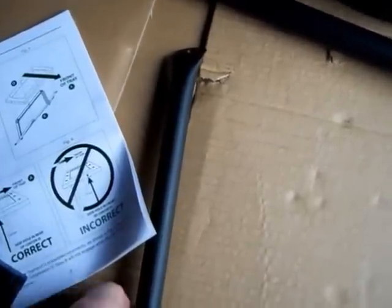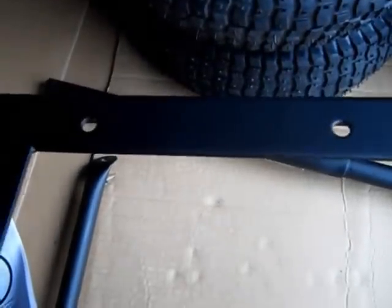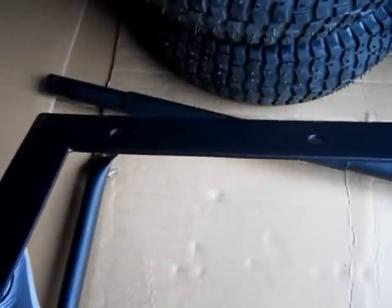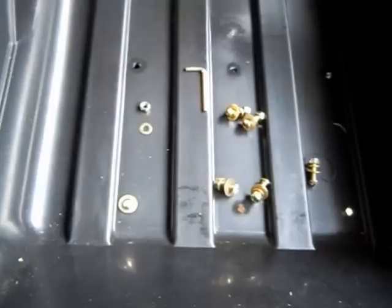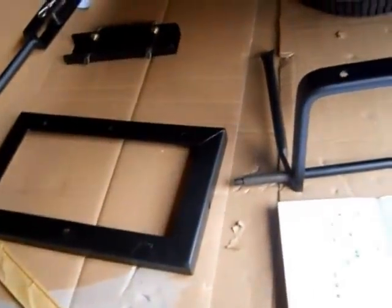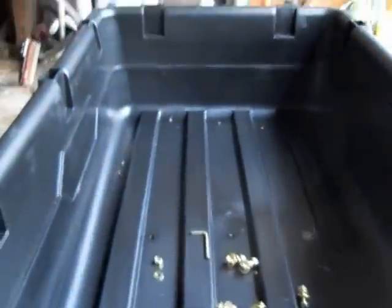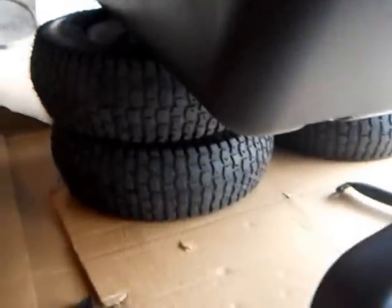I think I've figured it out. I slid them on so that the flat end is pointing down at the cardboard instead of up in the air, because when I put this frame up here it's going to slide up and fit flat against it — put it on the other way and it'll be pointing away. So when you slide your struts on, don't do it so they're pointing up; do it so they're pointing down. This step is critical and complicated — we're going to attach three pieces: the frame, the axle with struts, and the pan.